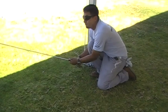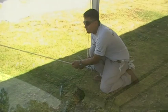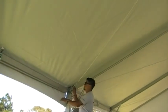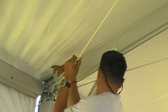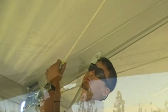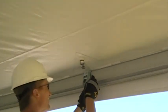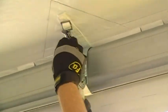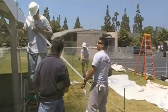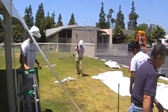You can now tighten your wall cross cables and the roof cross cables at each end bay. These cables will help keep the structure secure and square. Install the mid-span tensioners at each midpoint of each roof panel. Now install your external wind guides and drive the anchor stakes into the ground.